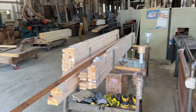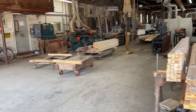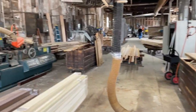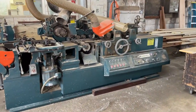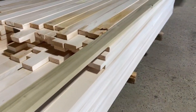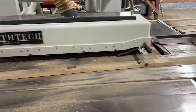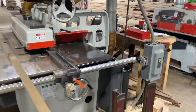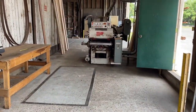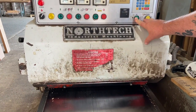There's a maple picture frame here, yellow pine casing and baseboard — this stuff is for an old renovation trying to duplicate original elements. They also have a large band saw for re-sawing boards when they need something thinner. This big double-sided planer does both sides at the same time and has a carpet feed system that adapts to the shape of the board.